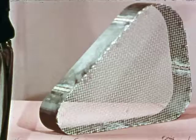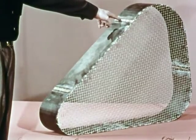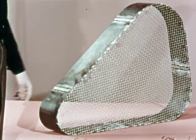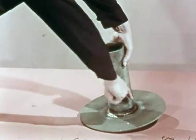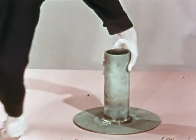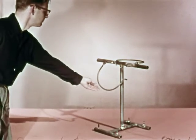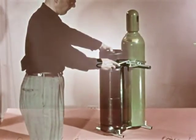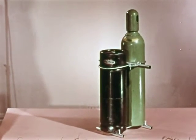When you braze weld cast iron or copper, use a welding tip two sizes larger than that specified in your welding tip metal thickness chart — it will help keep the welding heat even. Be sure that you don't overheat cast iron; just heat the metal to a dull red glow. This safety guard is one of the many things that can be made by braze welding — four pieces of sheet steel were braze welded together and wire mesh tack welded to the edges of the frame. Nine out of ten repairs in the shop or on the farm, and many of the things you can make from metal, can be braze welded. It's the easiest way to join most metals.